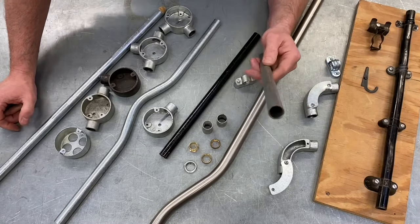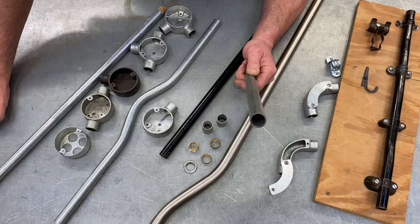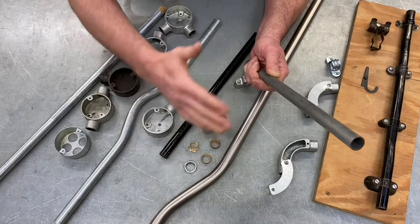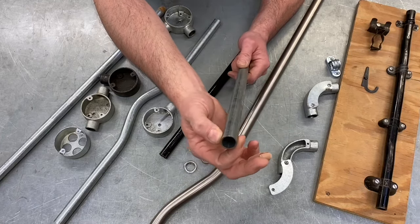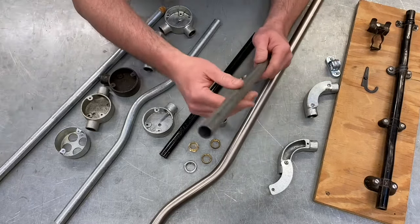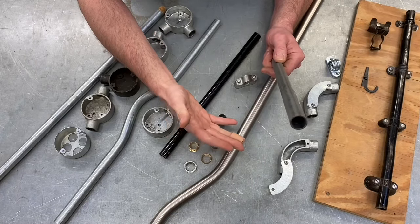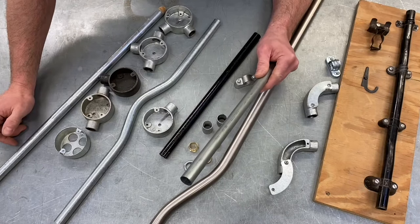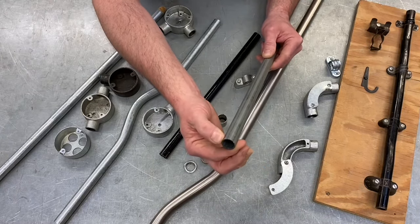Conduit comes in different sizes - the size being the diameter, not the area. The four common sizes are 16mm, 20mm, 25mm, and 32mm. For the bending radius, it's a multiplication of the diameter. For example, a 20mm conduit multiplied by 2.5 gives you 50mm - you'd set 50mm into your compass, draw a circle, and that gives you the radius. This is exactly the same process used for twin and CPC, steel SWA, mineral insulated, etc.